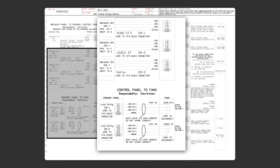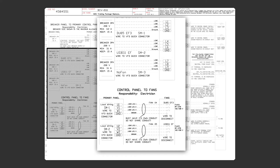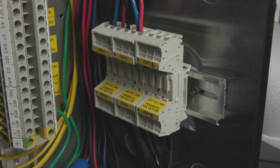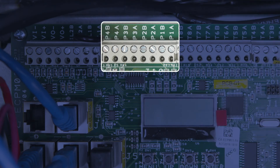For example, here's the wiring for an exhaust fan being controlled by a VFD. The high voltage wiring comes from the breaker in the building's breaker panel to terminals L1, L2, and L3 in the control package. Then the high voltage wire runs from the VFD to the exhaust fan — from terminals U1, V1, W1 to the disconnect on the fan. Solid lines are factory wired and dashed lines require field wiring. One specific note: the P terminals for EC motors are polarity sensitive, so double check this before applying power. Reversing polarity will damage the terminals.